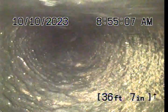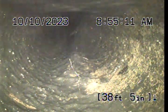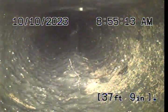In the Orangeburg, you'll see ovalization. There's even a blister coming down there. The bottom of the screen is the top of the pipe; where you see water flowing is the bottom of the pipe. This looks like corrugated pipe — that was probably a spot repair that was done. You'll see ovalization at this point specifically — right there's a good shot of it. What was a 4-inch pipe is reduced to pretty much 2 inches there.